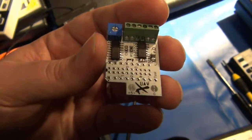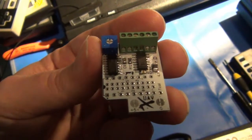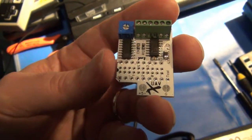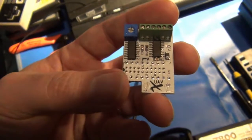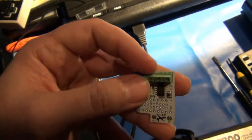Well, again, as near as I can tell, and again, I haven't read up on all the specs, but basically it's a complete replacement video encoder circuit for Atari systems. Basically, you tap the necessary connections you need for Luma and the color burst signals, and this captures them and re-outputs them to whatever you want on the opposite end here through this green connector.